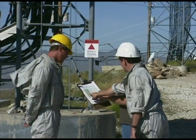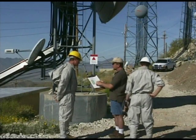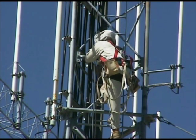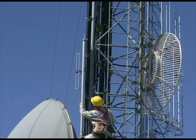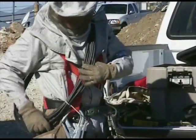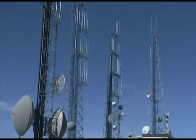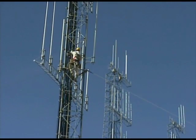If there are any questions regarding the field assessments or guideline definitions, consult the site or station managers for any necessary information and clarification. Once it has been determined that safe operation using KW Guard is possible, keep in mind to never handle energized conductors while working in a potentially hazardous RF environment. KW Guard is not intended as a means to handle hot antennas or directly contact live structures such as AM antenna towers. Caution should be taken to properly transport lengths of cable and other metallic elements that could resonate and become re-radiators of potentially hazardous fields. Following all of these essential guidelines will ensure a safe and effective means to manage a wide variety of tasks on the job.